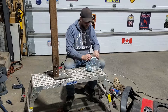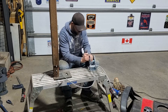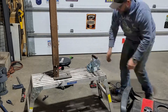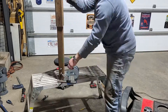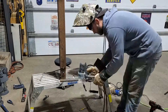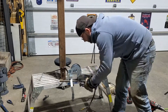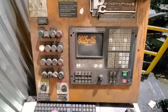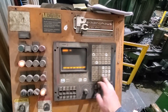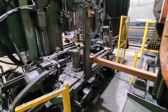Next, I attach the wire rope to the hand crank and test the lifting mechanism. With that working, I welded the hand crank to the mounting plate. For the lower section of the stand, I wanted quite a bit of adjustability, which meant a lot of holes to drill, so I cheated a little and used one of the metalworking machines at work to automate the process.